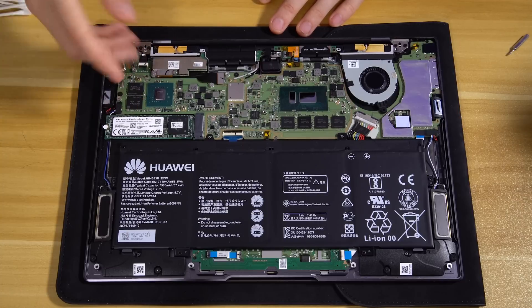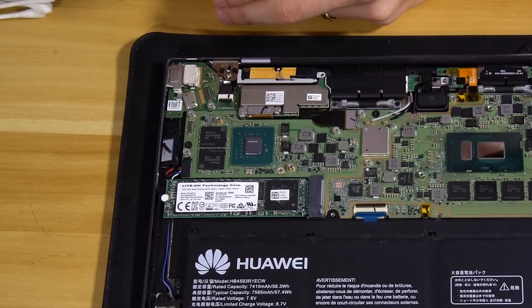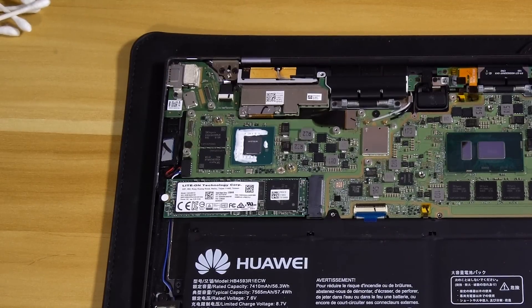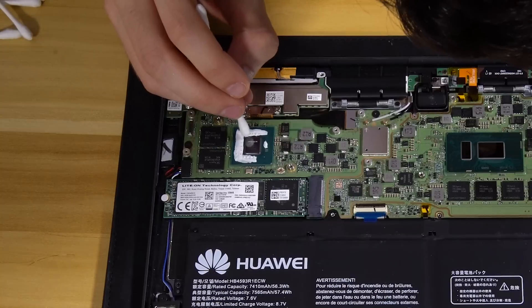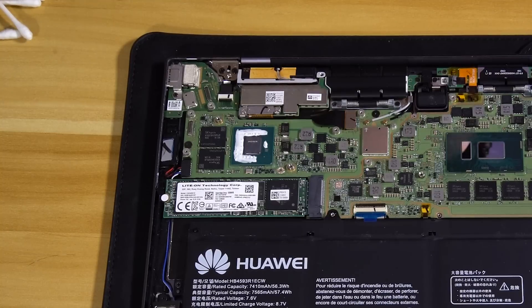We want to cover the SMDs with nail polish to prevent any liquid metal spillage from shorting them out — that would be catastrophic for the GPU and probably the entire system. I'm using white nail polish; most people recommend clear, but I already probed this paint and confirmed it's not conductive. Devour used red nail polish at one point, so if he used red, I'll use white. It looks weird but it'll do the job. A tiny bit got on the edge of the die — we'll clean that up.